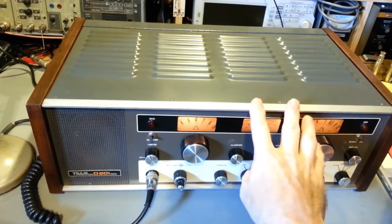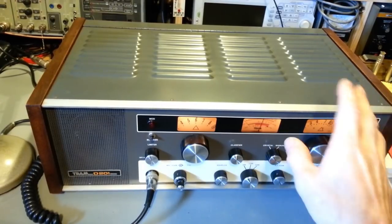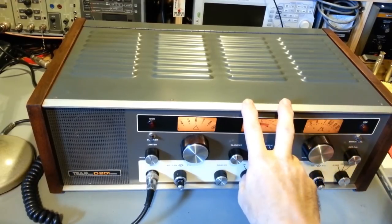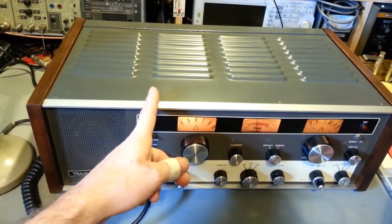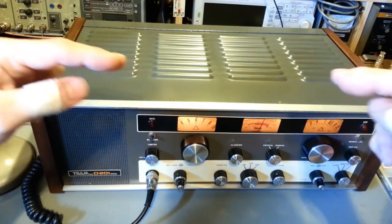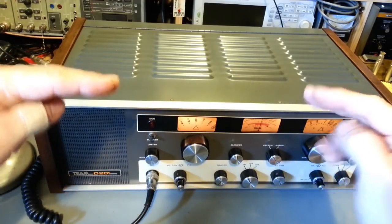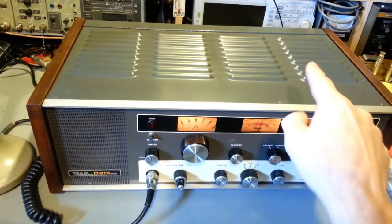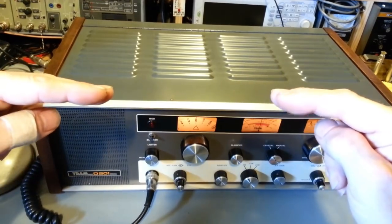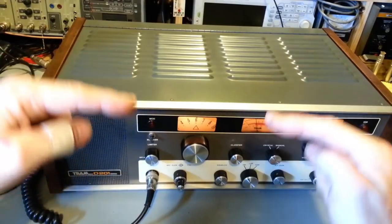And in this radio, because this is an earlier radio, the later D201As had the meter actually solid state controlled. But in these radios, it's two vacuum tubes. They're using a section out of one tube over here and a section out of one tube over here, and it's a balance. If you have exactly 100 volts on this terminal and 100 volts on this terminal, the needle will be at zero. You zero the needle with the zero adjustment inside, but there's no potential difference there. And when one becomes more positive or negative, the needle swings. But like I say, that's at 100 plus volts.